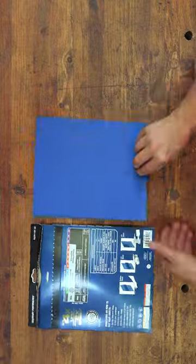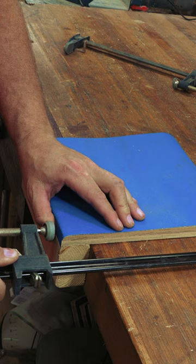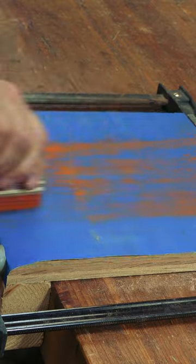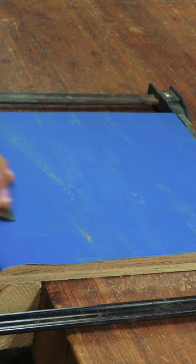The plywood is the width and a little less than a piece of standard sandpaper. To clamp it on, fold the edges of the sandpaper and add a couple of F clamps. Besides being able to clean the face of small things easily, I even found I could sharpen dull chisels with the finer sandpaper I bought in a multi-pack.